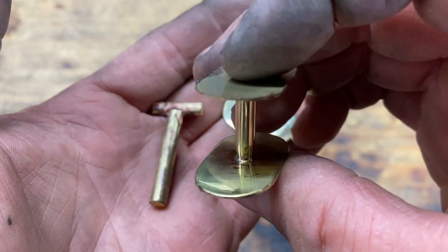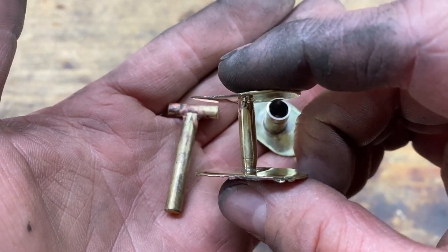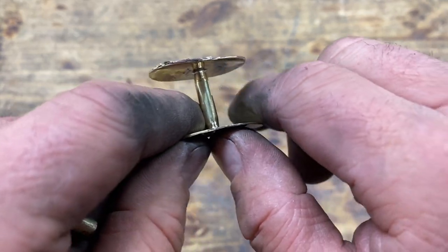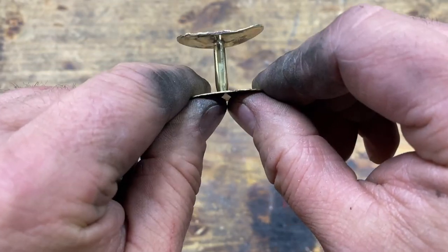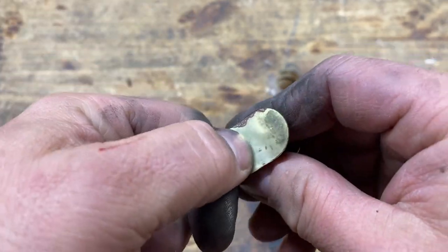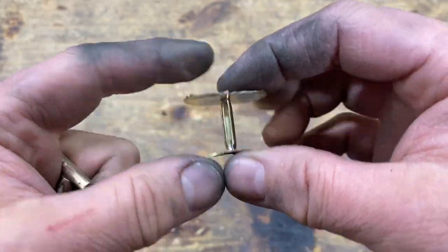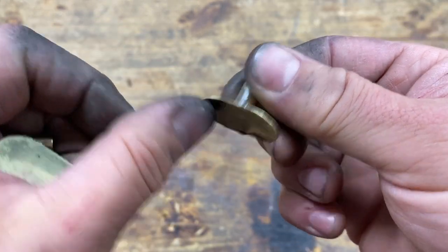These are just set, ready for your final buffing. Get them fit and dressed, clean off all the edges, and you're ready to put this on. Now remember, this is the side that we went ahead and annealed, so it's soft. This is the side that was not annealed — notice we can't bend it as easy. But this side is nice and flexible, so it'll take your contours really well. Then you just dress and get the rest of the heat marks off, and those are good.